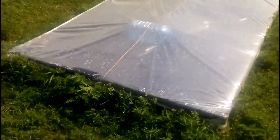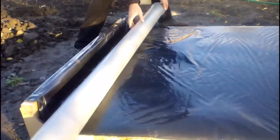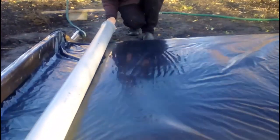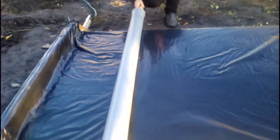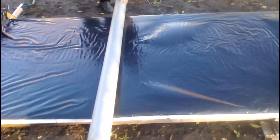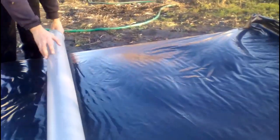Unfortunately, the rain does not wash away all the dirt from the surface of the film, and therefore washing the film every few months may be desirable if we use the film with a long life. In addition, sometimes we need to remove these air bubbles, and we see that this operation is very easy, and later I will show how we can quickly raise the transparent film to remove the bubbles. And I want to add that the problem of the bubbles will be less if the heating temperature is low, and if we use industrial water which was made through deaeration.